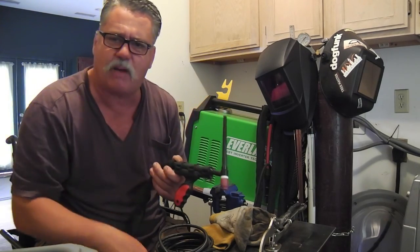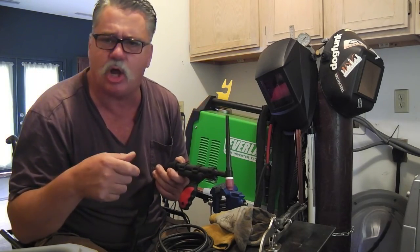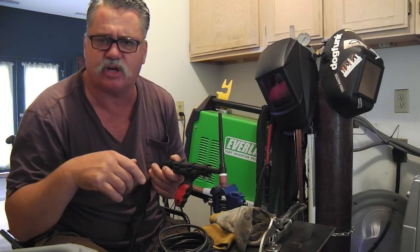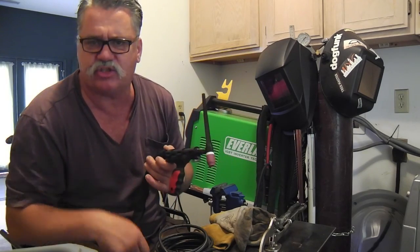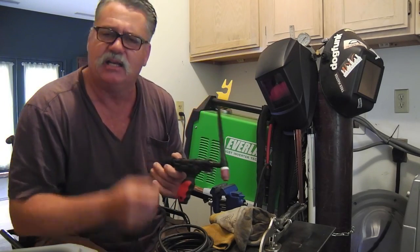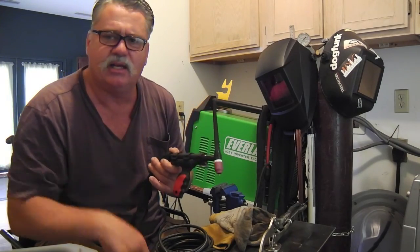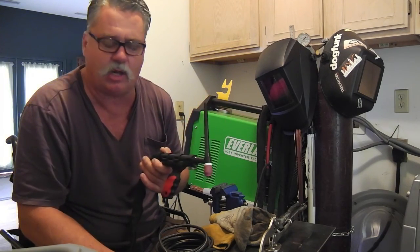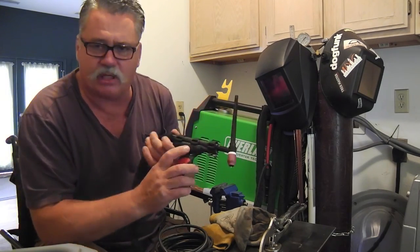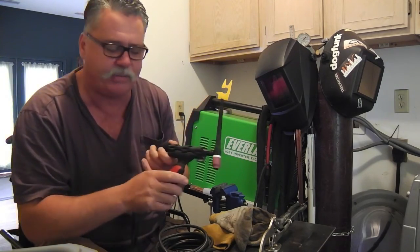The latest crop of Everlast units, both in their analog welders and their digital welders, are 47K ohm resistance pots. Apparently these digital ones aren't picky — they can deal with just about anything you throw at them. I don't know about the analog ones. And I really don't know what the pot is in this unit, but it may not matter for the digital.